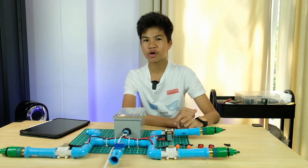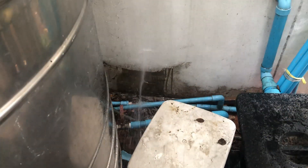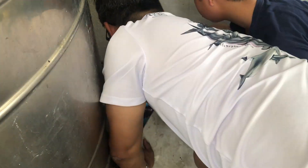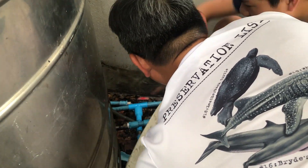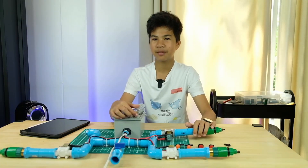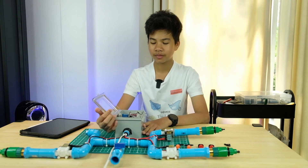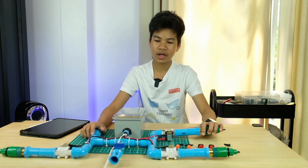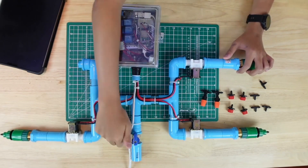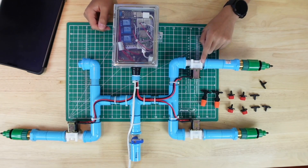That brings us onto the hardware. We have to do the plumbing from the main pipeline system — I'll roll the clips. We have a water tank and we will tap off from that into a half-inch pipe, running down to where we will install this, which is behind a bench. We had some leaks four times because we didn't install it properly using glue and pipe tape. The pipe connects here, and we have a valve to manually switch off if we need to do maintenance. We currently have three solenoid valves which will control the flow of three zones.